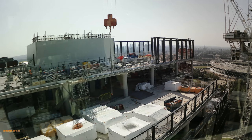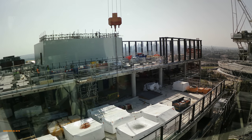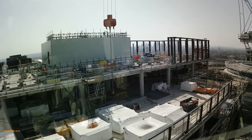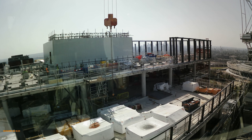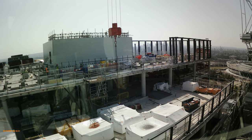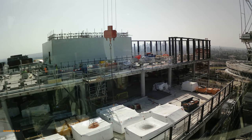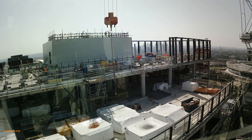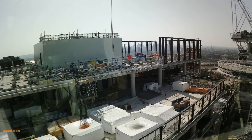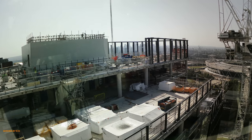When I go over there, there's not going to be any work to do — there might be a little bit of tidying up. There you go — I'm above it, there's no swing, I just go down to the load and pick it up. Now, that's if you're starting quite close. If you're 180 degrees from the target, the site isn't really going to be happy if you're going around in speed one all that way, so you have to have a little bit of common sense. That's tip number one.